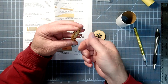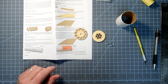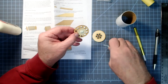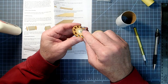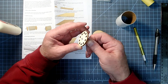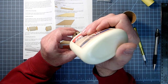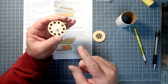Once you can see threads on the other side, that's enough — back that out. Now I want to squirt my glue through that hole. Leave a fairly heavy dollop on there. Put this into our threaded hole again — just until you can barely see the threads there in the glue. You don't want to get the smooth shank down in or it won't grip. Now that's poked through here, and I'm going to cover that with glue. That makes a really nice high-strength bond — we don't want this to ever pull out.